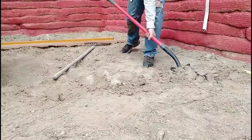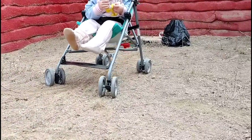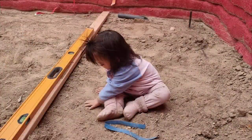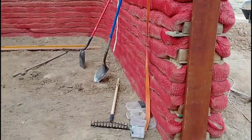Before Kyle got started on the walls, they did bring in all the utilities and get them stubbed up and ready to go, but not much else has been done on the floor surface. It's uneven and there are some bushes that need to be removed. The inside crew started by identifying the lowest part of the floor, then they're going to dig the rest of the floor down to that level, using an eight-foot-long bubble level to make the floor surface as smooth and level as possible. They're using a wheelbarrow to remove the extra dirt, piling it up outside to use later for the earthen floor.